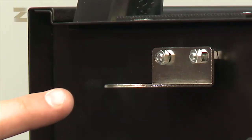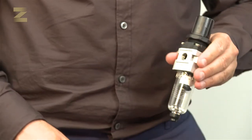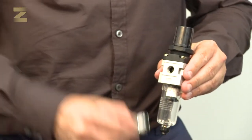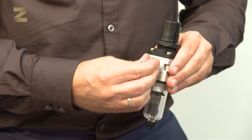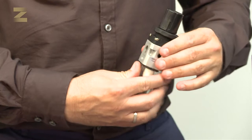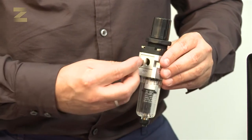In order to conduct plasma cutting, attach the supplied plate to the back of the machine such that the screws will be located at the bottom of the plate. Screw in the screws and tighten them well. Take one connector, wrap its thread with Teflon, and screw it to the regulator inlet and tighten with a suitable wrench. On the left side of the regulator, which is labeled IN, attach a quick connector.